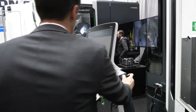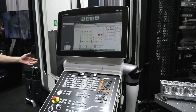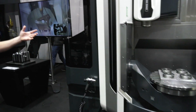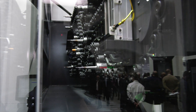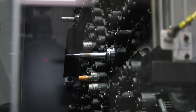The control is on a pendant which can move between the pallet station and the machine. Another aspect is the tooling side — you need to change and set tools, and that's all been considered in the ergonomics as well. The tool loading is also right next to the working area from the front side of the machine, so the operator has, within a distance of less than two meters, all the things he needs to operate during working with the machine.